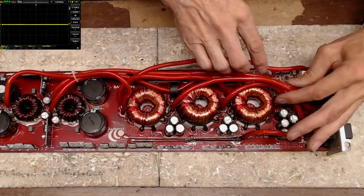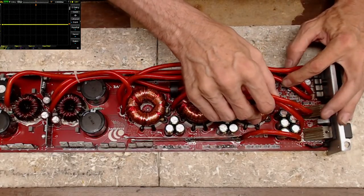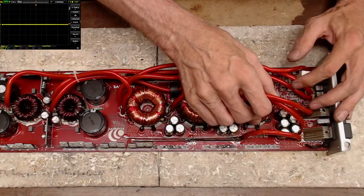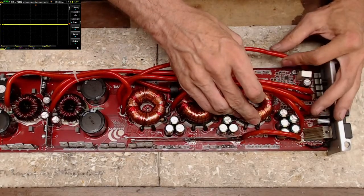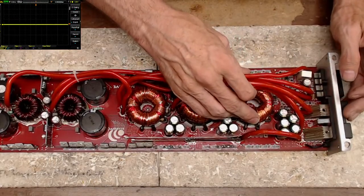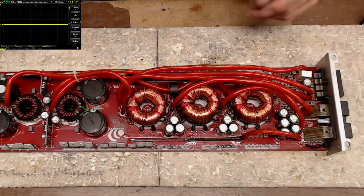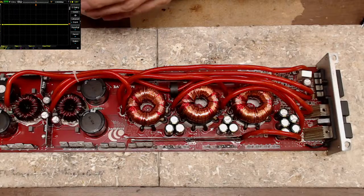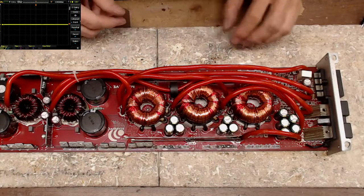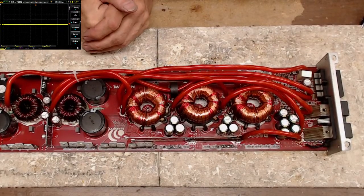It uses a standard, yeah, it's a Type 4 drive. It uses the 494 and goes to the typical transistors here. It's almost laid out identical to a standard Type 4. So if the 1018 is a really close equivalent to the 3205, then I'd probably use 3205s just due to availability.